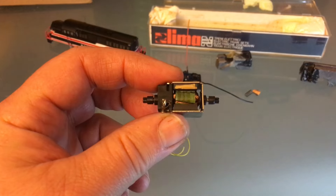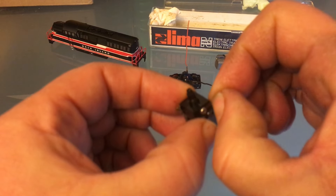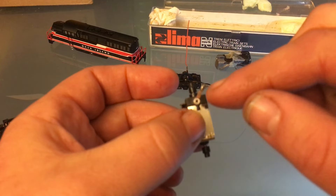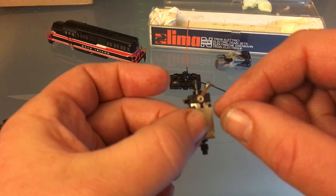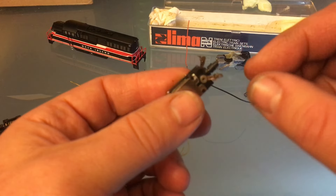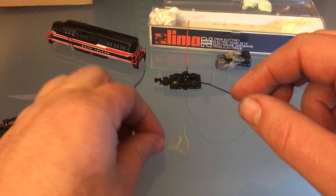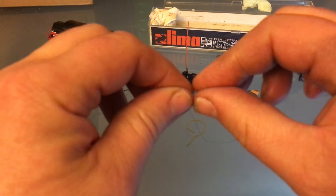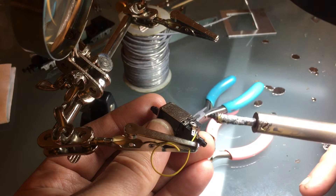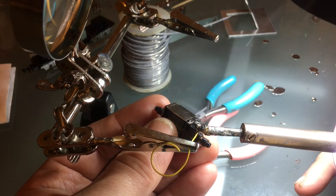It's a good runner. So I'm going to rewire everything. I'm going to clean up these strips. Now, if I was being good, I would take them off the engine before I solder them. In fact, I'm going to solder them like that — because if this part gets too hot, it will melt the plastic and you won't be able to hold your brushes. This would be a good time to change your brushes, for sure. So I'm going to use my solder to clean all this up first, then I'll pre-tin my yellow wires and solder them in. I'm trying to make this solder as neat as possible because it's cramped under there, and I want to have as little wire as possible.